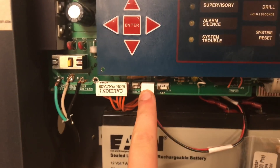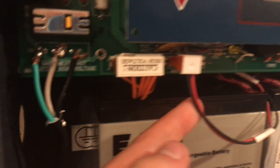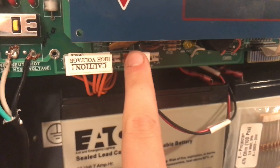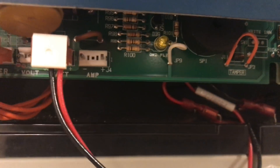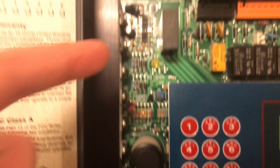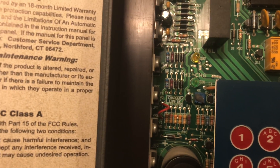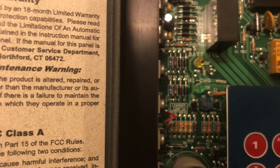Right here is your battery input — this is a special plug on Honeywell panels that allows you to hook up your batteries. Right there is an LED that is your ground fault LED, which will come on whenever you have a ground fault. Up here are two more LEDs: a battery trouble LED and a high charge LED that will come on for those varying conditions.